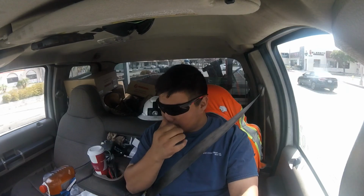But what I want to explain to you is this low oil level switch on Mate. If you own one or if you work on them, very few people know this, but they're obsolete from Mate. Mate is no longer putting low oil level switches on their units. And all it is is a safety sensor. If the machine runs low on oil, this sensor turns it off.